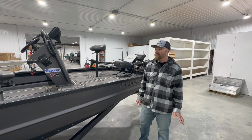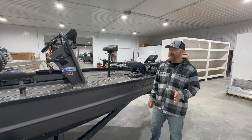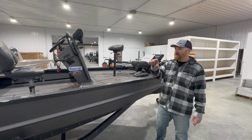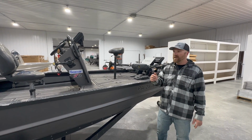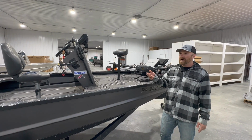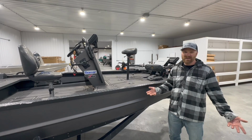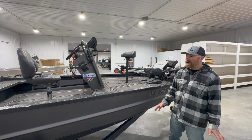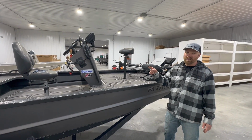I had a few things, nothing major, but around 200 hours it threw a code and a sensor went out. I was able to read the code and call RockProof, who helped me out with it, and then a Sea-Doo dealer provided me with a part. It was just a little sensor, I think it was like $40, not a big deal. Switched it out myself.